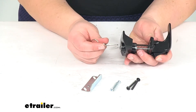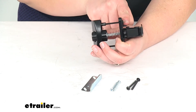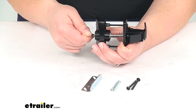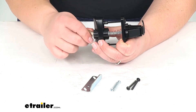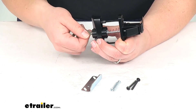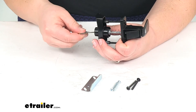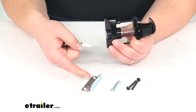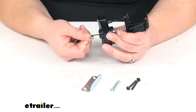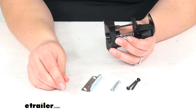Similarly, if we want to lock it from the outside, take our key, put that into the lock cylinder, and then if you watch that little tab up at the top, you can see it turn as we use our key. It might be kind of hard to see that, but it does move as we move our key. When it's locked, we won't be able to get back in. It also comes with the striker plate, so we can install that for the little latch to actually catch on and hold that in place — so there's something for it to hold against.